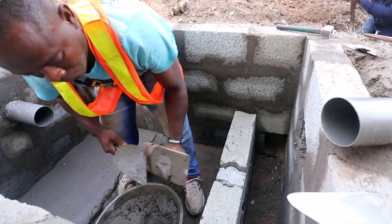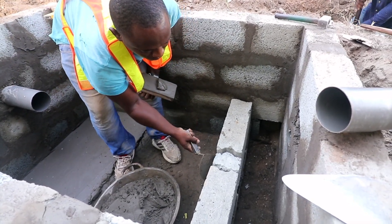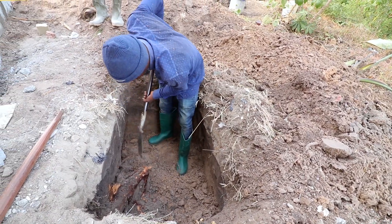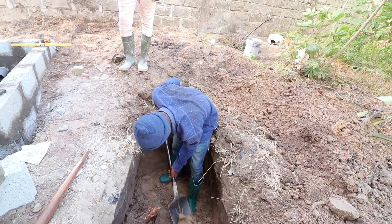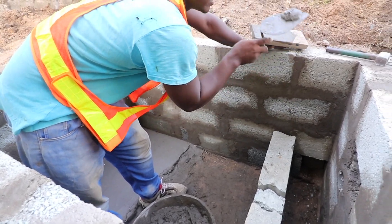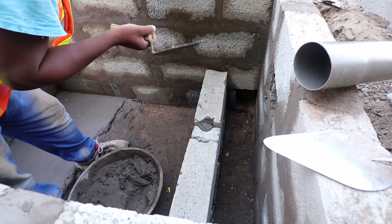The screeding also has to be done with the slope and gradient leading to that particular water soak away, and then you know you are good to go. We are doing a separate soak away and at the same time an overflow — in case the soak away is not soaking, the water will pass through the overflow pipe.